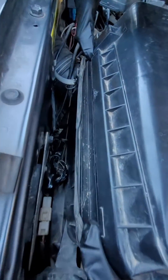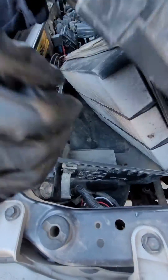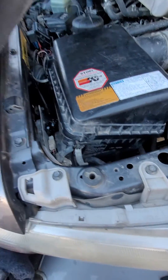When it does go over the side of the air filter, as we can see here, it catches the edge of it if you're not careful and pinches it and pulls it off. Then of course you've got lots of dust going in, and you can see complete dust trails here — it hasn't been sealing.